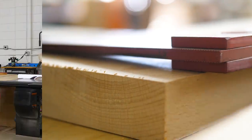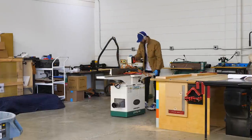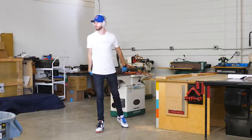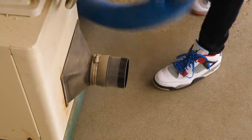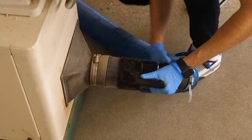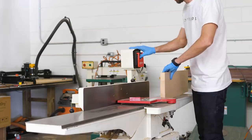The first thing that I did was break down all of my boards of beechwood into more manageable sized chunks using my jigsaw. Then I could joint one edge, rip the other, and cut my ends square — basically getting myself to where I had some nice pieces of wood as a starting point for refining things.